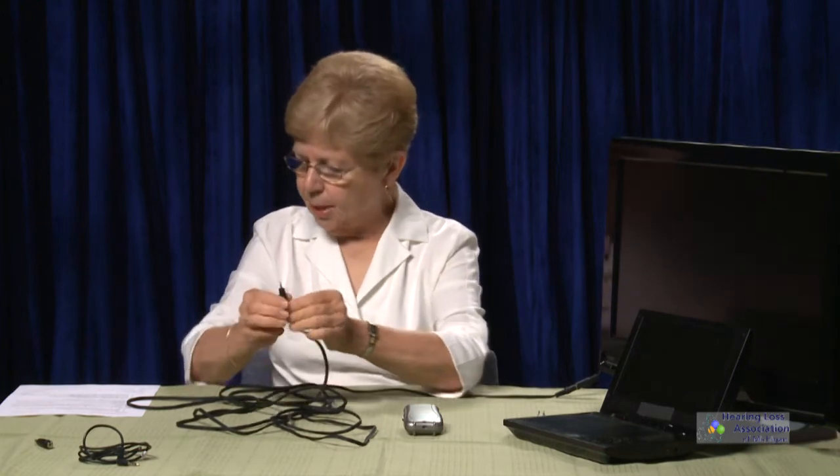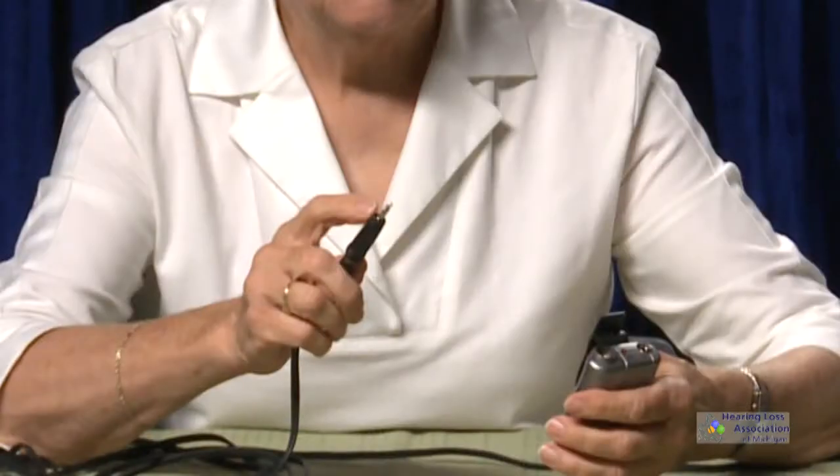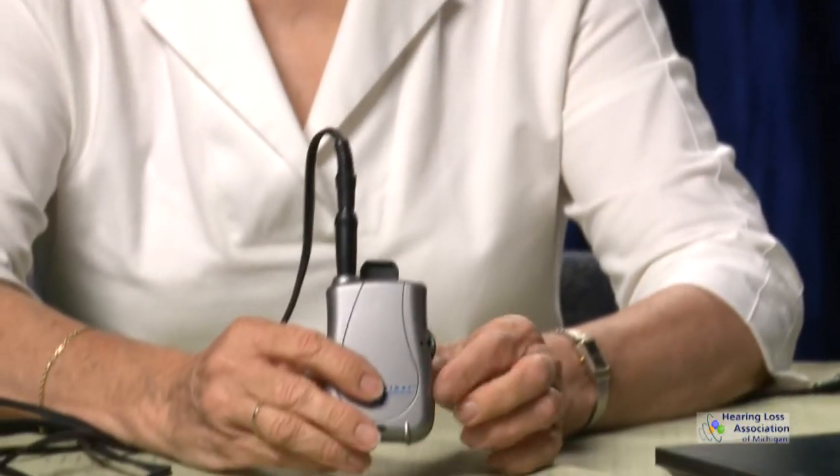On the other end I have a micro mini stereo 2.5 plug. Remembering that the Pocket Talker has a 3.5 plug, I'm going to need to use an adapter. The cable has a 2.5 stereo adapter on the other end, so I'm going to plug that into an adapter that is female with a male mono jack on the other end, and plug that into the Pocket Talker.